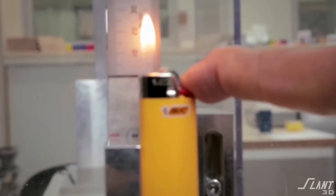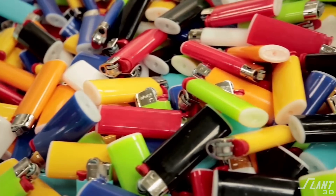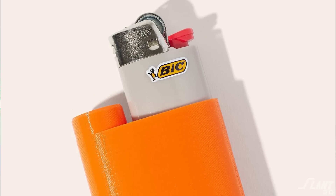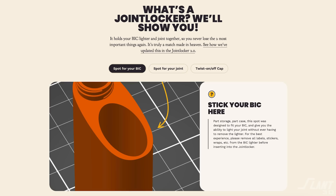If you want to create an accessory that presses together via an interference fit, you cannot rely on any datum feature from the lighters, because they will vary based on the company molding them. It will also vary based on whether the lighter is full or empty — both of which change how tightly it fits into a standard hole. We produced a batch and realized that lighters on one end of delivery would not fit, and traced it to injection molding tolerances not being high enough.